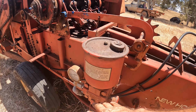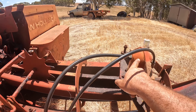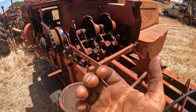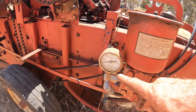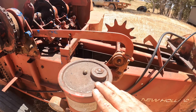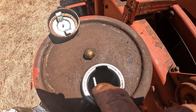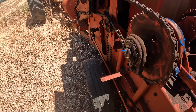We also want to check the oil in here. This is the mechanism that sets the bale pressure and changes your bale weight - there's a hydraulic ram which pushes down on this. The harder you push down, the longer it keeps the bale in the chamber and the more push you need to squeeze the bale up. We've got a pressure gauge to show how much pressure we're putting on. My hydraulic ram always leaks a little bit - I need to take that off and repair it. If we look in here, there's a little piece of metal and that's your oil level - this one's down a bit so I'll put some oil in.